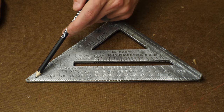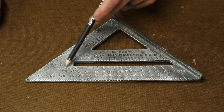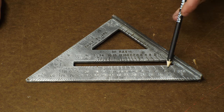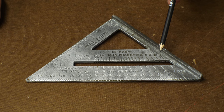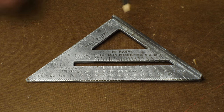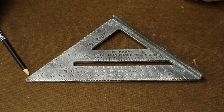When you look at the tool, you'll see a lot of different lines with several different indications. Along the bottom there's 0 to 90 degrees, and these are pretty obvious. The common indicates the rise in inches over a 12-inch run for common rafters. The hip val indicates the rise over a 17-inch run for hip or valley rafters. And usually one edge of the SpeedSquare has a ruler on it, so that's handy as well.